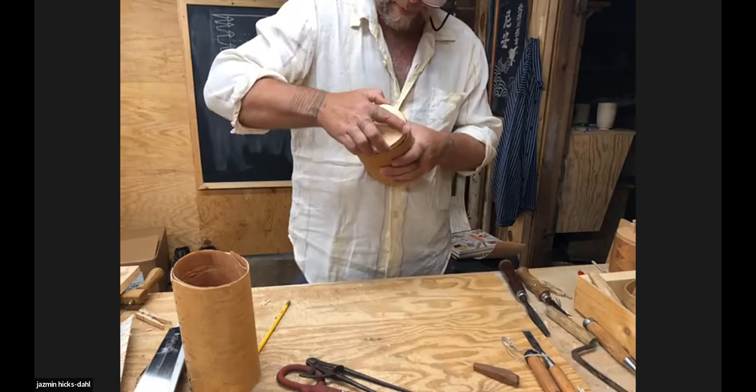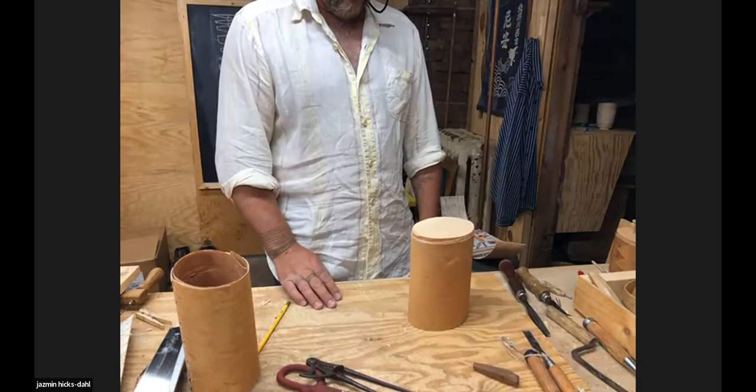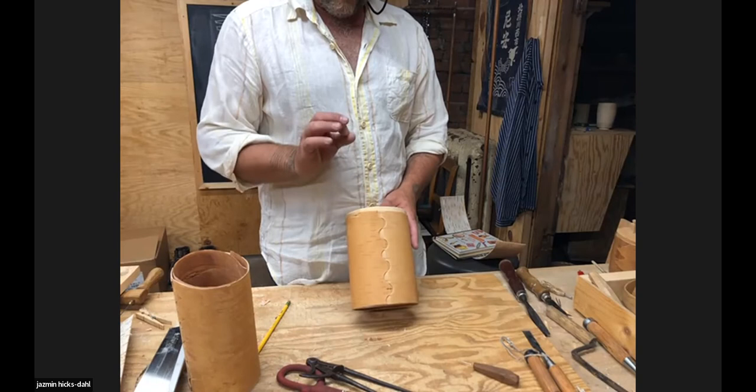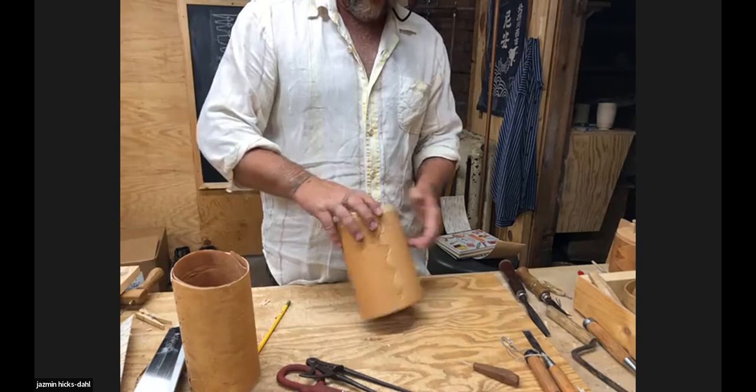Trim that, you know, bandsaw it, cut it, trim it, carve it with a knife, rasp it, and it should fit into the box neatly and still stick out. And that 6 degrees is about perfect. Too shallow, it'll get wedged and you won't get it out. And too blunt and it won't stay in. Give or take a half a degree.